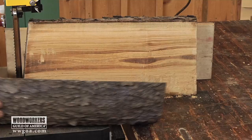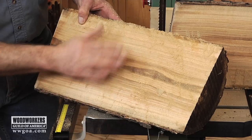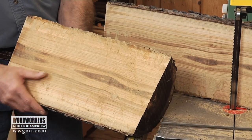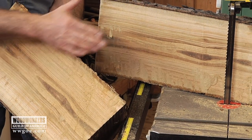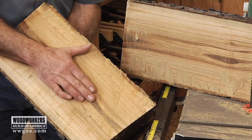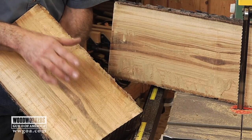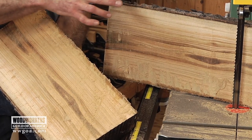Now let's have a look at what we have inside here — that is some really, really neat looking grain out of this cherry. Now if we look at the two half sections together, what we've cut is called a book match. That means the grain on this face is the perfect mirror image of the grain on this face. So it's another benefit to doing this: if I keep track of these pieces, I could put them into a project one next to the other — think of a pair of raised panel doors where the grain perfectly mirrors from one door to another. By keeping track of your pieces, you can have your own book match.